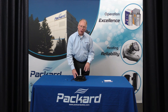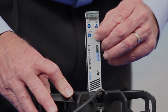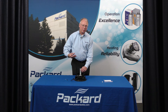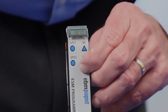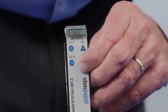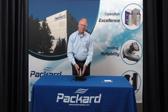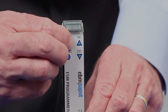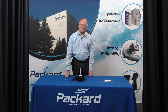Then to go to 1800 RPM, I need to decrease the speed setting. As I hold the decrease arrow, initially it'll change in 10 RPM increments. As it is depressed and held, it will speed up and those increments will increase in value as it approaches 1800. As I get closer to 1800 RPM, I may want to jog so that I don't go past my target speed. Now I have speed 1 set at 1800 RPM. I want to save that speed setting — to do that, I depress and hold speed 1. To verify, by pressing that button I can always determine exactly what that speed setting is set at.